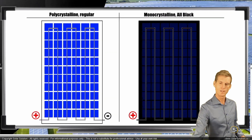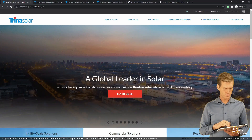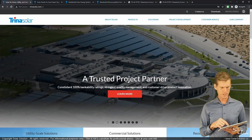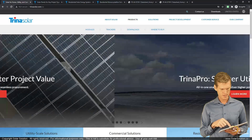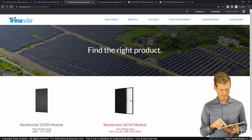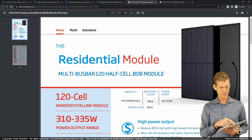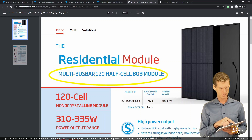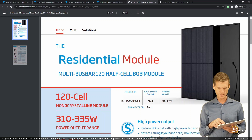Let's take a small excursion online and go to the website of trinasolar.com — I am not affiliated with Trina Solar — to show an example of these all-black photovoltaic modules. Here on the website, we go to Products, then Modules, and scroll down. We select a residential 'Sleek Home' solar module — let's go for the 335. As always, let's go straight to the specification sheet. It is a 120 half-cell monocrystalline module — that's the first step. The 'B.O.B.' likely refers to black-on-black, indicating they've changed the color of the backsheet — that's the second step.